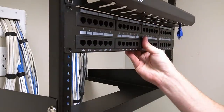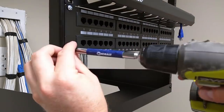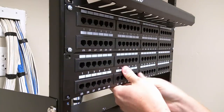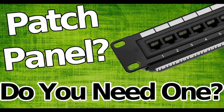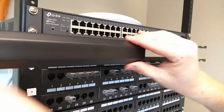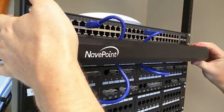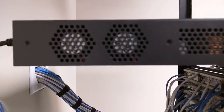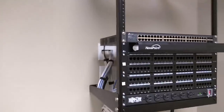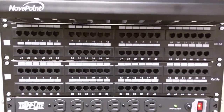The patch panels were next. A patch panel will allow a point to terminate the wires running through the wall. In my opinion, a patch panel is a must for any serious network setup, and was a must for this project. For more detail on patch panels, you can check out my 'What is a Patch Panel and Do You Need One' video — link also in the description. Next was the rack mounted cable management panel, which will help keep any cables coming from the patch panels to the switch orderly. Lastly, the switch, which is a TP-Link 48-port PoE Plus managed switch costing a little under $500. Pretty overkill for a home setup, but it will provide the power and manageability that a small to medium-sized office could benefit from.